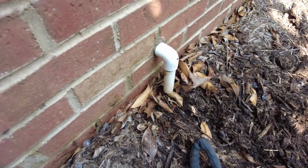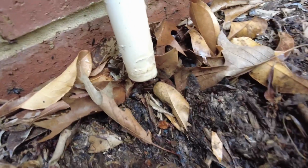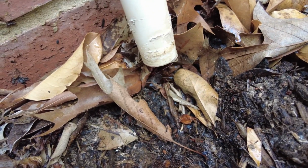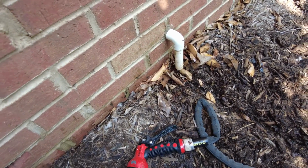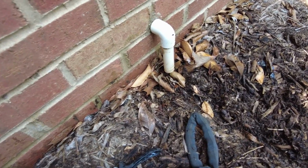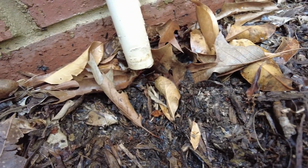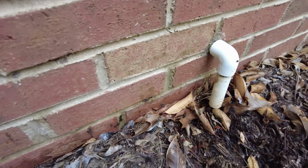Yeah, wasn't really expecting that. I thought this was gonna be a 5-minute call. So glad I did decide to shoot it. So yeah, I don't often do those hydrostatic clean outs like that on drain lines, but anytime you do that, you want to make sure you thoroughly inspect and test the drain. I've already tested, made sure the water came out here, and it's got a steady trickle.